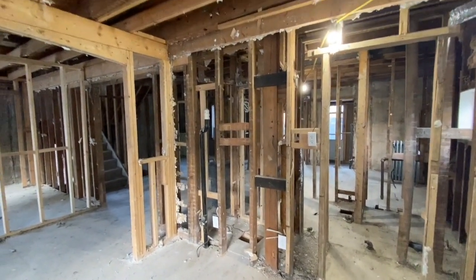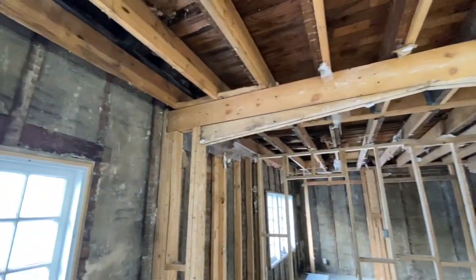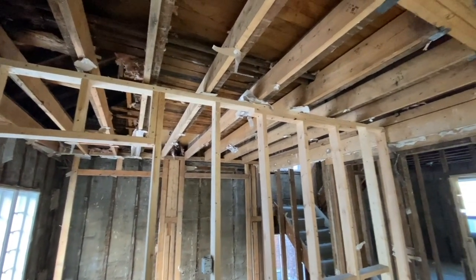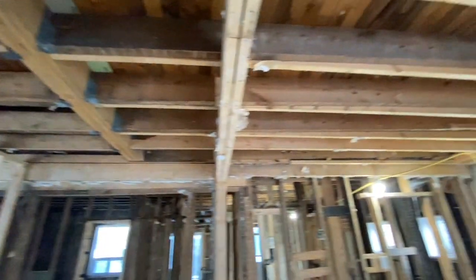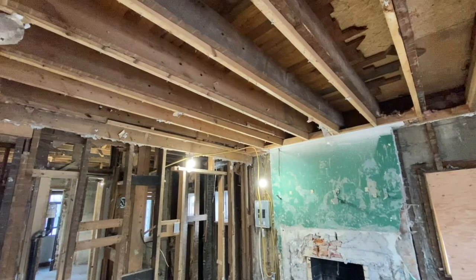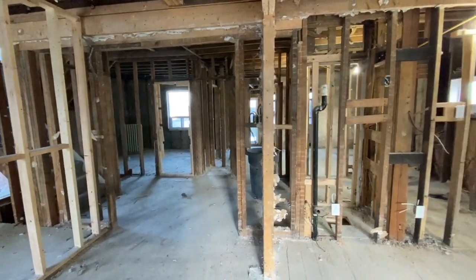That's all been opened up. You can really see on this floor the difference between the new framing and the old framing. You can see that the floor joists were sistered because they're sagging from above - they didn't structure this properly. Everything has been doubled up, tripled up in some cases. They did that to try to level out the ceiling and put in some extra support, but it's really not working all that well. Essentially all of this framing on the second floor is all coming out - we're going to take every piece of framing out and redo the floor structures here.